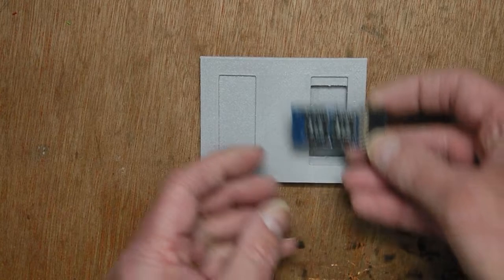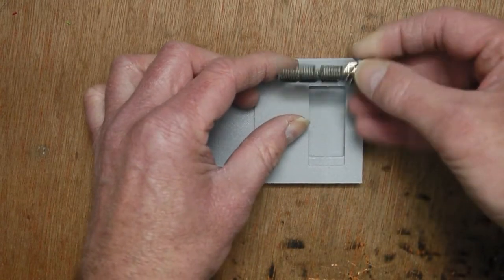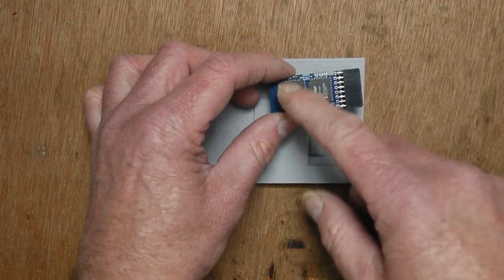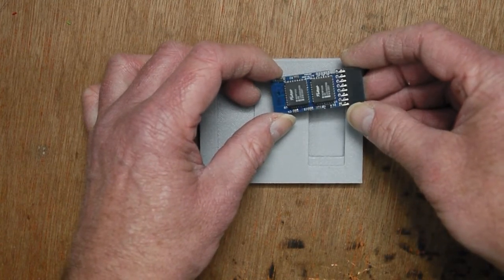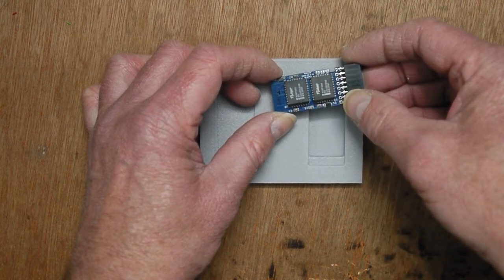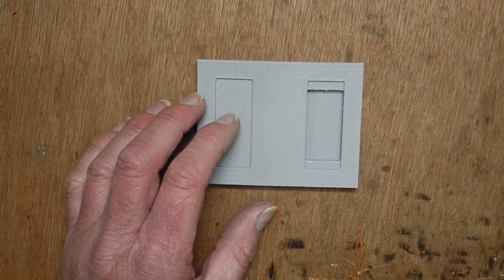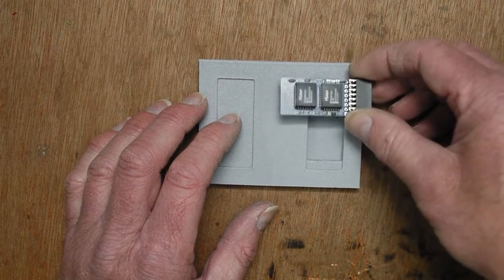So there's 4 jumpers on here, so the size can be changed, down 1 power of 2 and up 2 powers of 2, but you've got to get chips that match, and so far I've only got the 512K versions. I don't know, it might be possible, I suppose, if you leave one chip off to make it a 256K. I haven't really looked at that. It's designed for 2 chips. Might work. Yeah, so I'm going to make quite a few of these, and they'll be floating around.